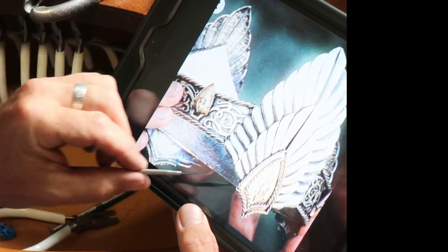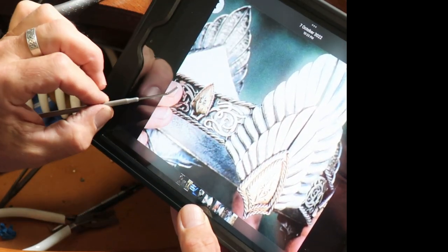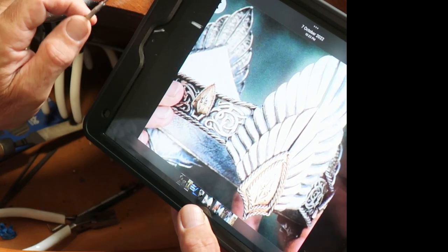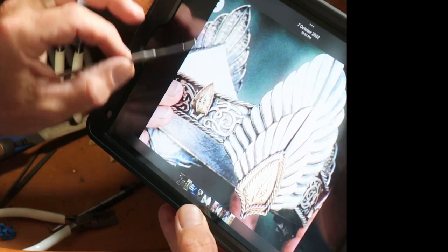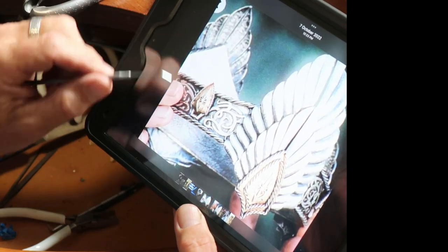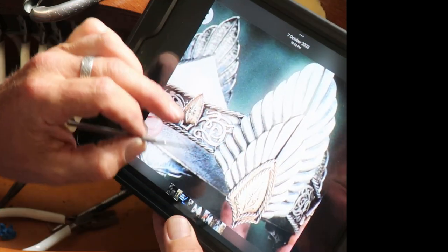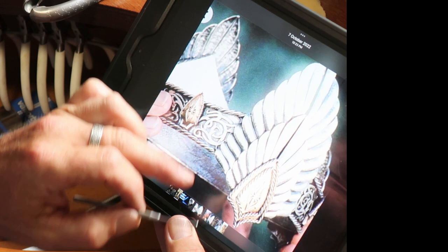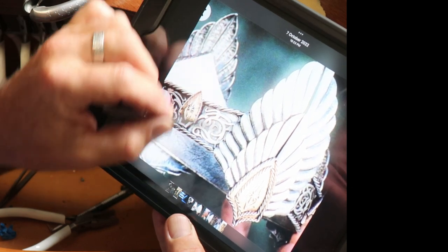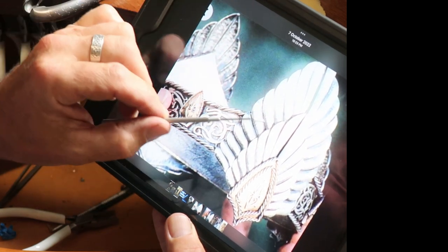Let's start with the main part of the crown. The body of the crown was basically patterned in heavy paper, laid out flat, cut from copper, and bent round to what we were told at the time was the correct size — that's a whole other story. Once that was joined, it was a matter of putting on all the details. First, mainly the winged crown, the feathered parts. This was all done out of sheet. Each of these was a separate part cut from flat, and we'll insert the video of that shortly.